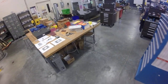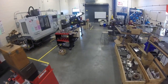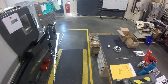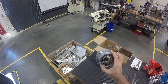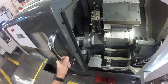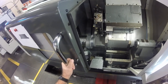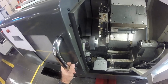I'm going on the shop here now because I've got a government job — something I need for myself. We've been working on it in class, making something similar to this bearing adapter right here. We've already machined one side of it with our big pie jaws. This is kind of large for this machine, but we were able to do it. We weren't able to cut the part off; we really don't have a long enough cutoff tool, so we went as far as we could.